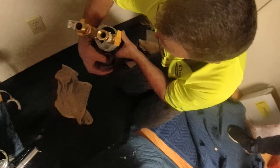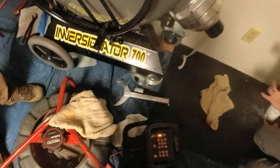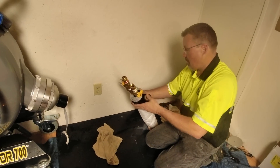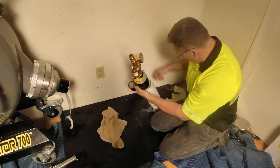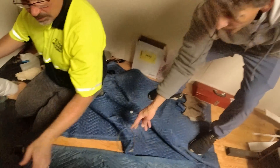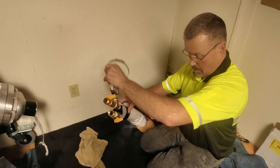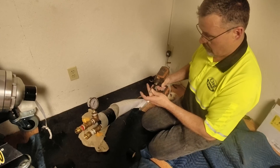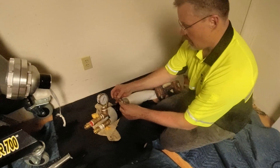The hot water is piped down to the far end of where the liner ends and is pushed back to us and out the adapter head with some pressure on the calibration tube to keep the liner in place. I have never used that adapter head since I learned the inversion drum can hook up water to it. Besides, when we're done curing the epoxy, we have to hook this calibration tube back up to the inversion drum so that we can pull the water out and pump it topside to get rid of it — so many extra steps that led me to realize it was just pointless to do this.